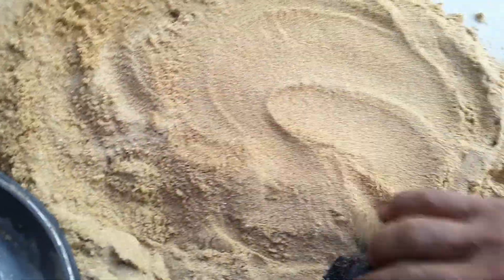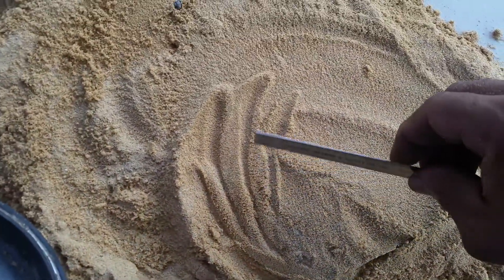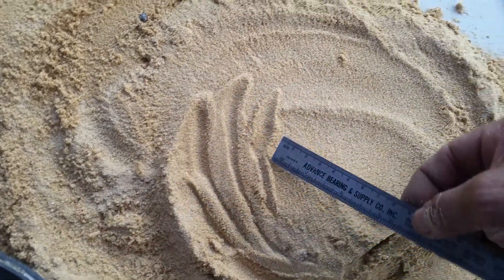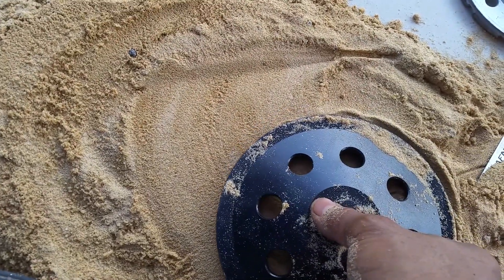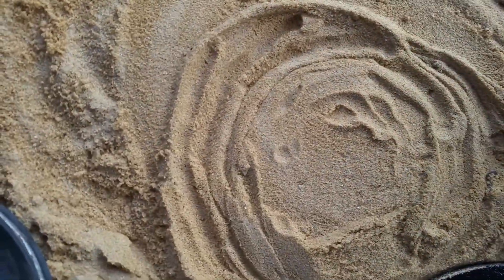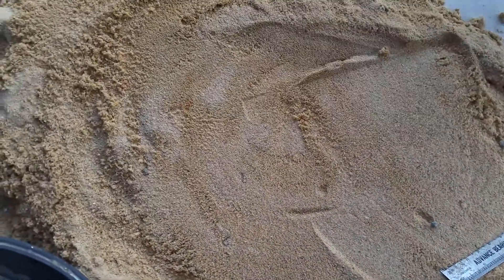The more you press down, the deeper this goes. At a very slow speed, pushing forward, you'd see the pattern - it's skipping as the teeth turn. That's the first tooth, second tooth, third and fourth tooth. It skips this area here, so that's why you'll see material left. But if you go slower with the same blade and allow each area to do a little more work - push it out of the way like that - you're going to get more of a radius, more work done in the same spot. You shouldn't have to push down too much with these aggressive ones.